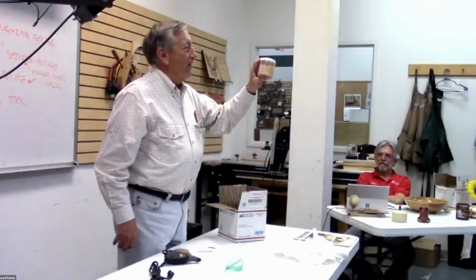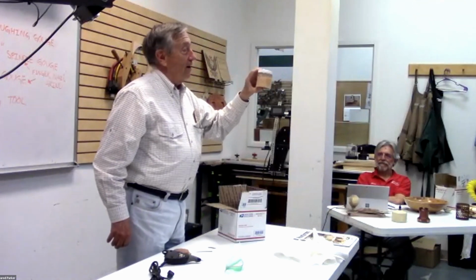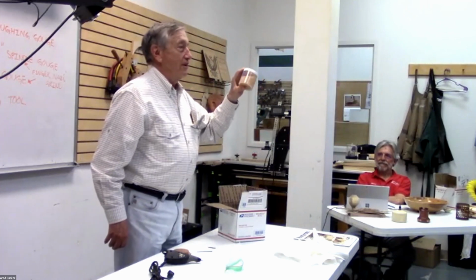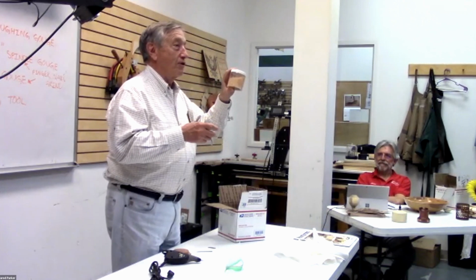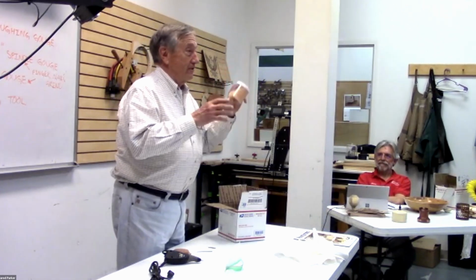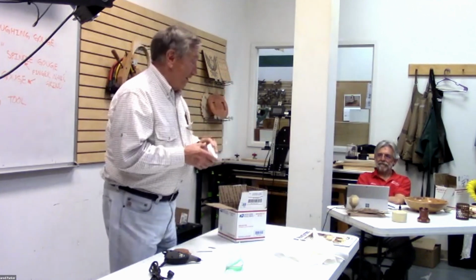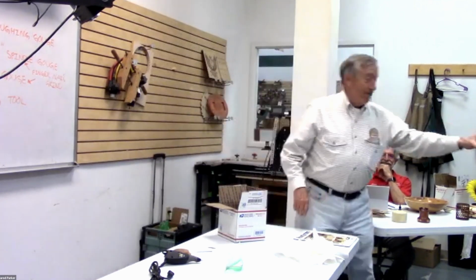This is by the gallon, and the white desiccant is the most efficient, and there's one company that sells a brand that comes with a little bit of orange in it, so that when it gets 50% consumed, the orange turns a deep green, and then you put it in the microwave for 10 minutes and restore it, and it lasts forever. So I'll pass that around. You can take it. Just don't open it up because these damn beads get on the floor. You never find them all.